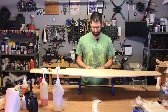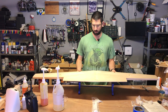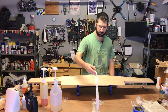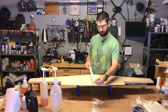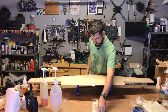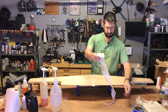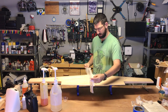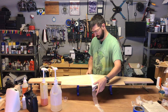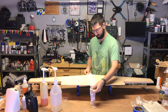So the next step is we want to fiberglass this wing together. That is going to be the main strength of this wing. To do that we will be using some composite resin. The first step is we're going to take the thicker fiberglass and we're going to lay it in the center. This is usually all that's given to most kits and it should suffice for the strength. However, I like to take some extra fiberglass cloth on top of that — it's a little bit thicker — and we'll lay that over there as well, and that kind of spreads that load just a little bit.